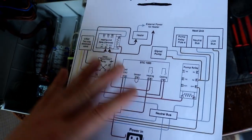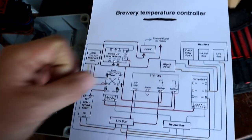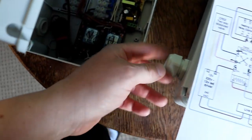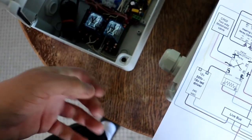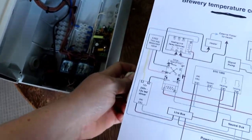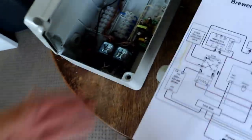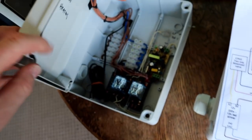To join them together, I'm going to go to Screwfix and Tool Station today and pick up some four pole push connectors. All we'll have out to the side of each of these boxes is two cables — one in and one out with a push connector on each — so we'll just be able to disconnect them by pulling them off, and we can pull the fermenter out without having to mess about getting inside the box to disconnect wires.